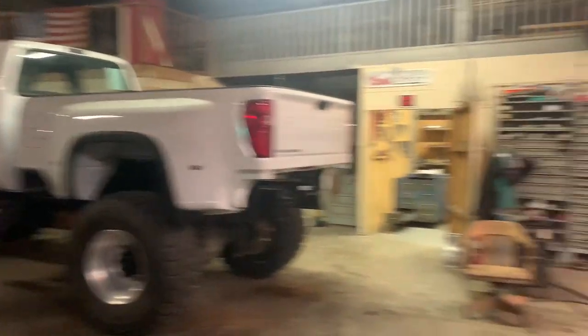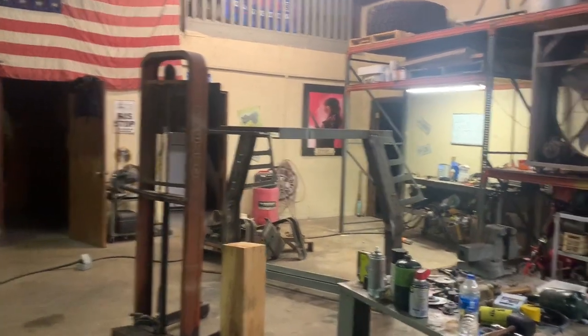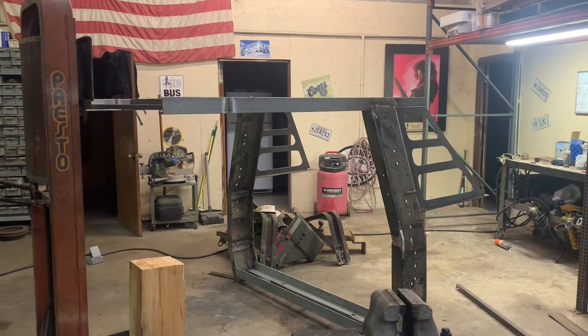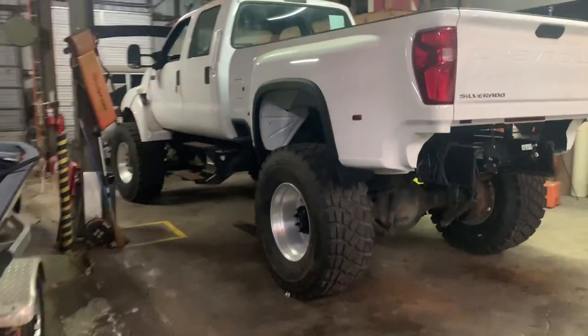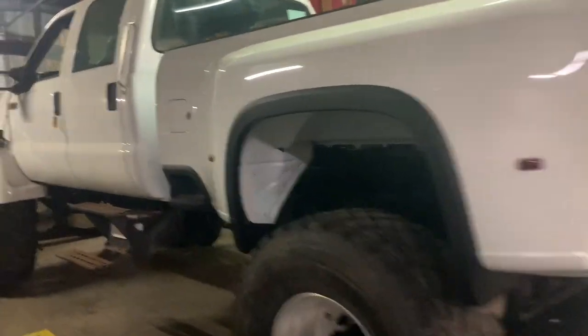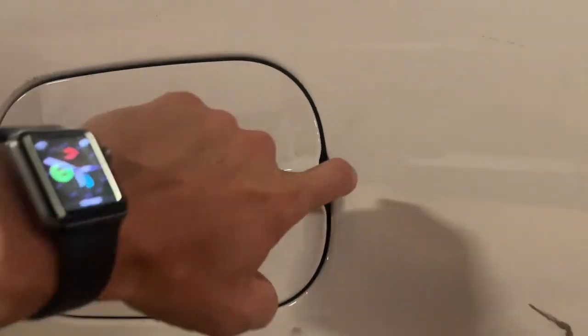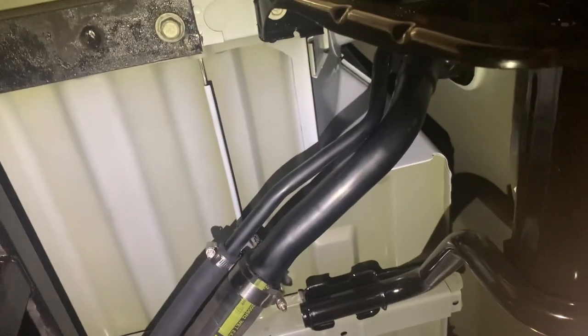Rear lift on, front lift on, fuel tanks deleted - time to jump back on the roll bar. The fuel tanks and filler neck are connected, which I'm very proud of. It functions like a normal fuel filler neck - just open the door, take the cap off. All the fuel lines and vents are hooked up properly, that actually ended up being really nice.